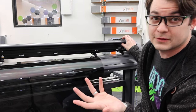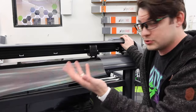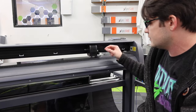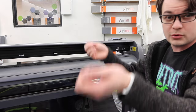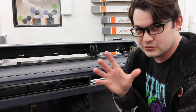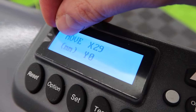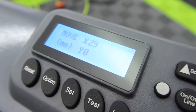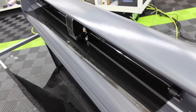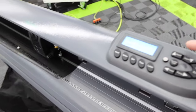Roller positioning aside, there's the plotter setup. On a lot of plotters it's all automatic — the plotter head goes to one side, you spit some film out, and it automatically retracts to find the edge of the film and start cutting. You can just throw the roll in, click a button, and go do something else. This is a more manual process but it's not too painful. There are just a couple of things to show on this menu. First you do the peel — you have Move X and Y. The plotter head goes back and forth and you press these buttons to spit out or retract film, then when you have it where you want, you click this button right here.